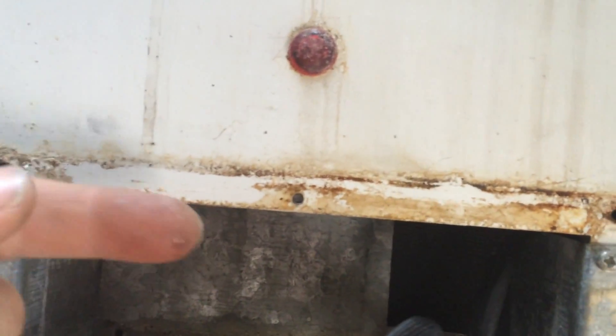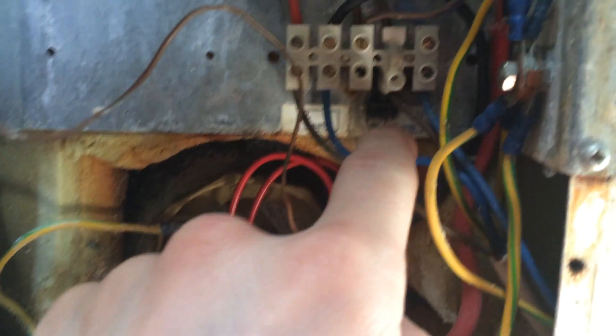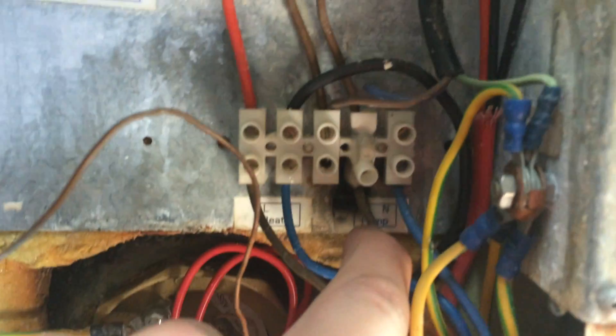I think the water's running down inside the tank, getting on this little ledge here and then getting through the screw holes. Luckily the stat looks like it's okay. That little fuse holder there — it seems to be wired in to do the pump, on those two brown wires. So our live comes in for the pump, goes up through the fuse holder, back down again, then off to the pump itself. We can take these away from that terminal block — they're probably better off left floating in the box so they're not tied to the back where they'll get wet.